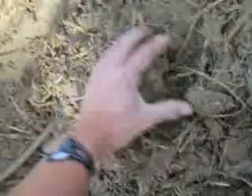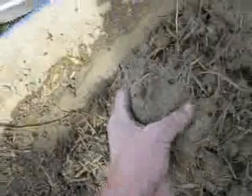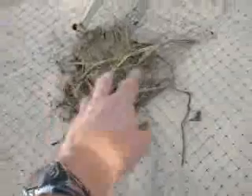Now, here we go — we have our mix. It looks like dung, I guess, but it is cob. It's a little bit wetter than a normal cob mix. Lots of cob people are probably horrified by this, but it's a slightly wet mix — I have to have a wetter mix for this. I did add a little bit of water while I was adding in the clay. Next stage, I'm going to put a few blobs around the feet to hold the feet in position, and then I shall continue on and build up my parabola from the outside field side.